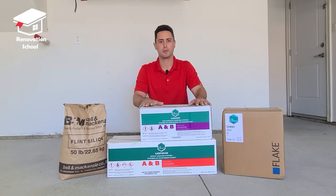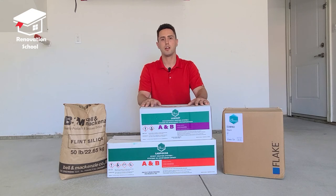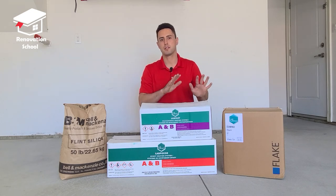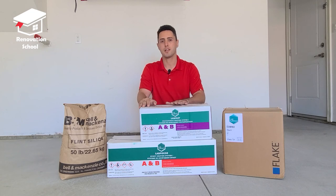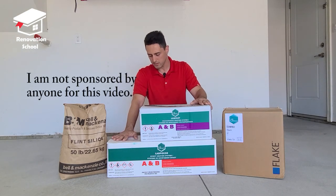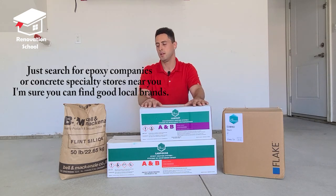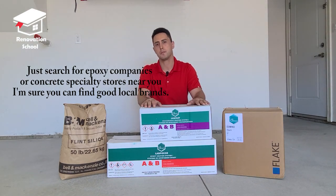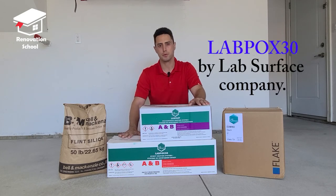This is the most important part of the video. A lot of people go to Home Depot or Lowe's and buy that cheap shelf epoxy — it's extremely low quality and if you're lucky you get four or five years out of it, in Canada maybe two or three years. The reason is it's only 50% epoxy. This product I bought is a 100% solid two-part epoxy. If you can't get 100%, Sherwin-Williams has an 85% option which I've used before with happy clients. But this is even more superior, so I decided to go with this for the sake of this video.